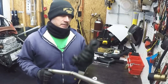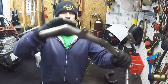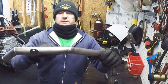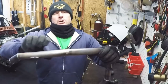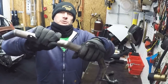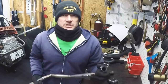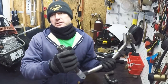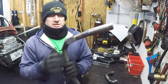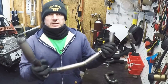This is the finished piece — it's just like the first one I showed you, all pie cuts. You can see this one's a 45, these are 45s, and this one is about a 30. With pie cutting you can get creative — if you don't rotate them all the way, your angles become less. The front of the Ecotec engine is inch-and-a-quarter, so this is all inch-and-a-quarter pipe, but the radiator is inch-and-a-half. On the last segment I went from inch-and-a-quarter to inch-and-a-half to match the radiator size. I've also got a tab that bolts onto the intake manifold and a tab that bolts onto the chassis by the radiator to make everything nice and rigid.